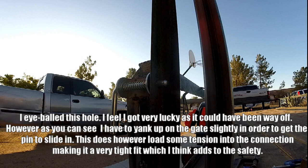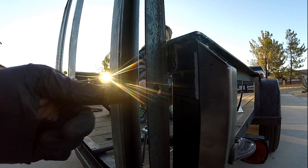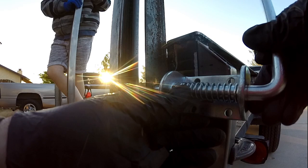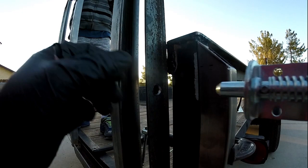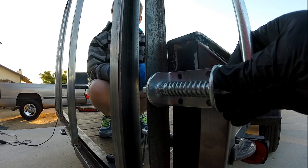Here's what I learned on the first hitch: I welded this in place, I welded this in place, and then I guessed on the hole — man I was lucky, it's not perfect but it is super tight. If you just lift up on the gate a little then this slides in. What I learned from that is this time I did this first — I drilled the hole first where I wanted the gate, got this mocked up, and then I positioned the latch and cinched that thing in place while it's locked. There's a guaranteed no-fail there. Even tire guys can figure stuff out.